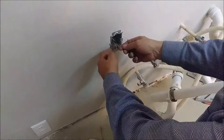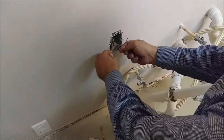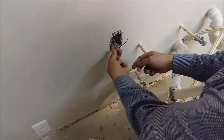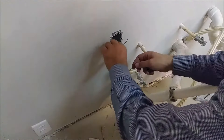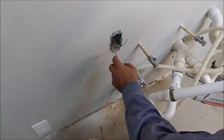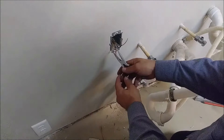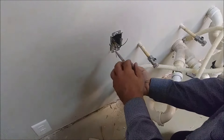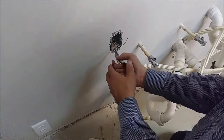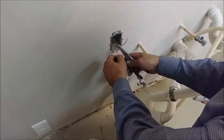For the ground we have two wires here — one and two. I'm going to twist them together so they become like one wire. I'm doing this because I want to use only one wire to put on the screw. I take the wire and twist it really tight to make sure there is good contact. And there is contact here — far more than you could even think.